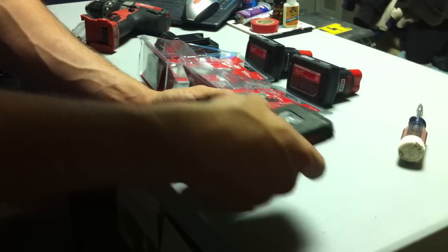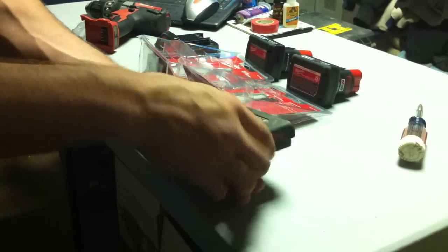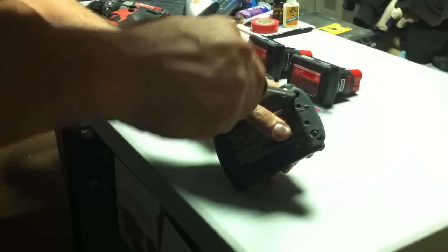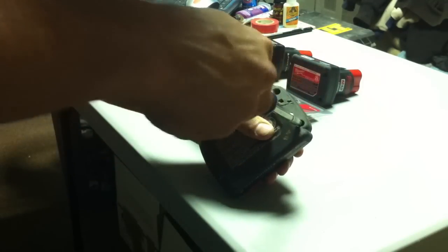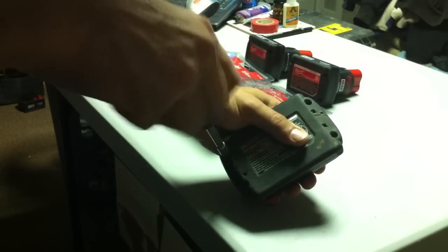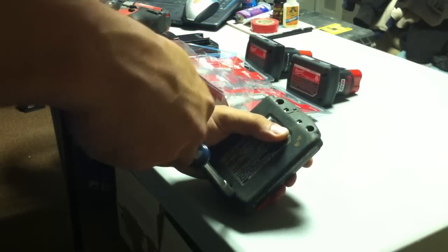Samsung seems to be a pretty decent cell, though not top rated. It actually seems like almost all the other manufacturers have a higher amp draw on their cells. I think the Sony ones go 20 to 25 amps, the A123 cells go up to 30 amps of discharge, and it seems like the Samsungs are between 15 to 18. But that's plenty of amperage. All of these batteries nowadays have little BMSs and protection anyway, so you're not gonna damage your cells by drilling a big hole.